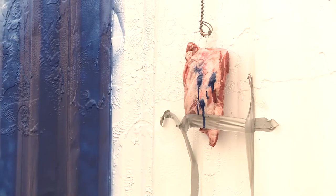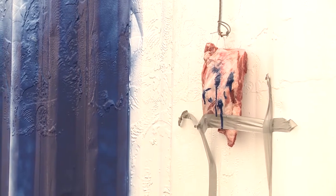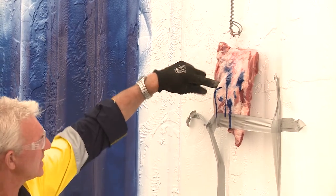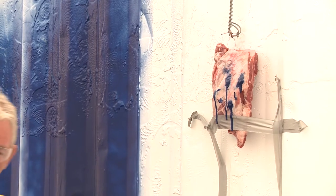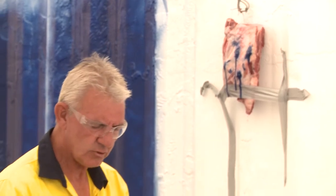This piece of meat is exactly the same as your skin. So if you're not careful and you pull that trigger, you can see here how it's cascading out of the hole — and as I push it, more paint runs out. That's exactly what will happen to you if you're not very careful. The tip itself is a dangerous piece of equipment.